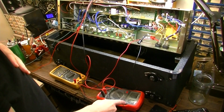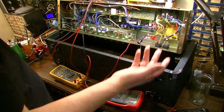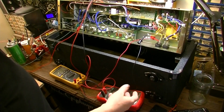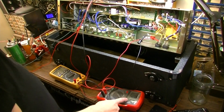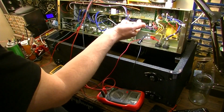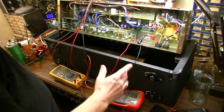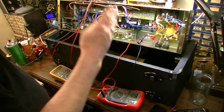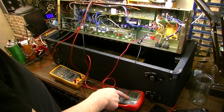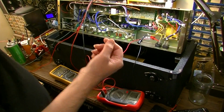And I think I was mistaken on the millivolts that you're supposed to set this thing, or milliamps, the current draw, which are exactly the same. You measure in millivolts on your meter, but it corresponds to milliamps because you have a 1 ohm resistor to ground on each of these sides. So it's exactly a 1-to-1 ratio. So 71 millivolts measurement also equals 71 milliamps.